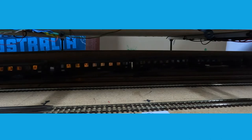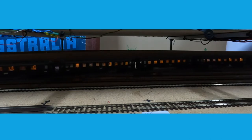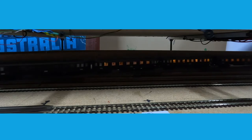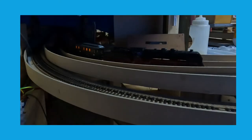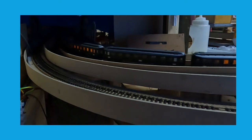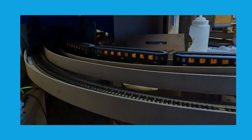Sometimes you can't eliminate flickering purely because of geometry of the track. What we're trying to do is get as much pressure down on the track as we can to have good conductivity, but obviously the weight of these items is prohibitive. So flicker-free is almost like a little battery backup system to prevent flickering.